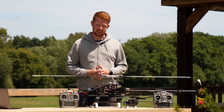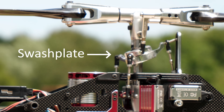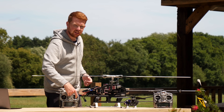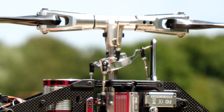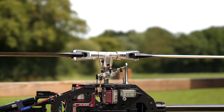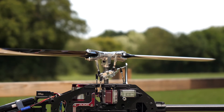Let's talk about helicopter physics. This part of the rotor head is called a swash plate and it controls the pitch and roll of the helicopter. If I push forwards on the controller, you see the swash plate tilt forwards — but the pitch on the blades barely changes. What it actually does is change the pitch of the blades at 90 degrees to the axis you want to move, because gyroscopic precession delays rotation 90 degrees from when maximum pitch angle occurs.